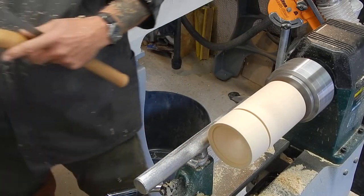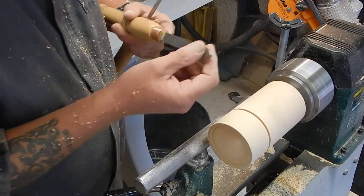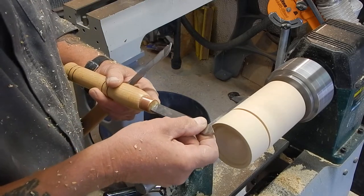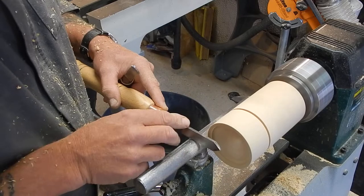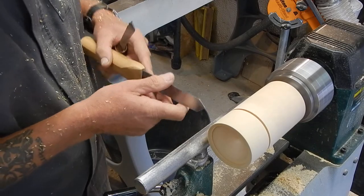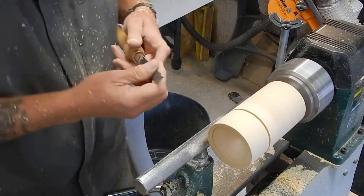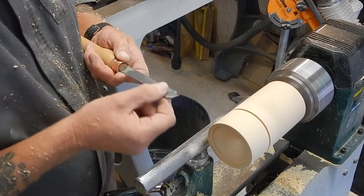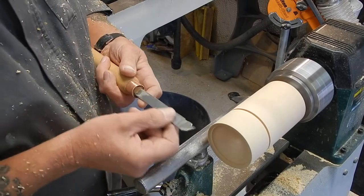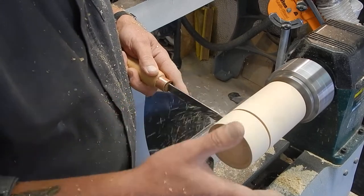When you're using a normal parting tool, you need to make a little relief cut, because it's all the same shank, so it will bite as you go in. If you use a thin parting tool, it's the same; you're going to need to do a little relief cut. But with the carbide tool that I use, I have the benefit of a 3mm tip and a 2mm shank, not really a bar, is it, really? This bit's 2mm and this bit's 3mm. So that enables me to get a tool where I don't have to make any relief cuts.